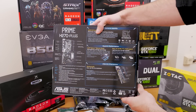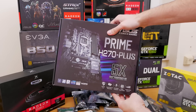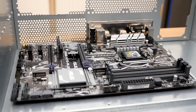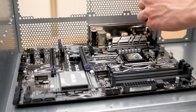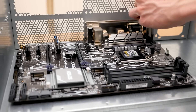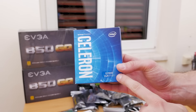The most important part is a motherboard that supports six or eight GPUs, so I've linked some in the description. We are using the Asus Prime H270 Plus. This board has six PCIe slots and two MPCIe slots, so in theory we can mine with eight GPUs on this board if we use adapters for the MPCIe ports.